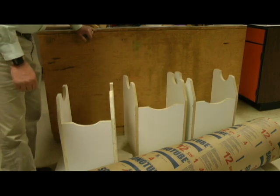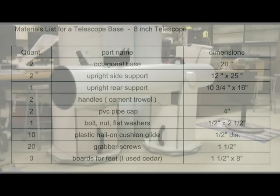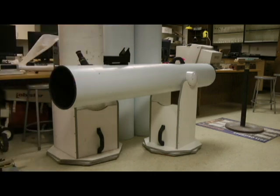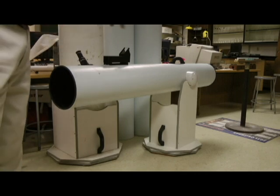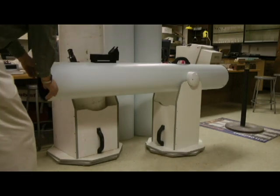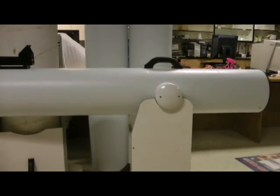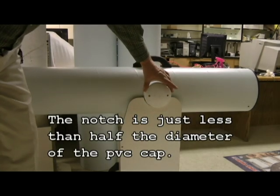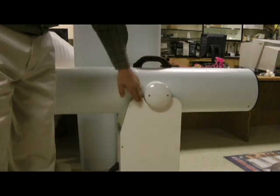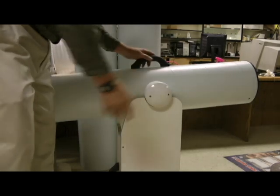You can see the actual finished base on the telescope. It's got octagonal bases — two pieces. These are 20 inches across in each direction. You can see the upright pieces, and I've also notched into the upright pieces — the notches are taken around the top. On this one I used a four-inch outer cap, though typically I use an inner cap. The inner cap just has the lip around the outside. I like the inner cap a little better because it doesn't grind on the inside of this one.